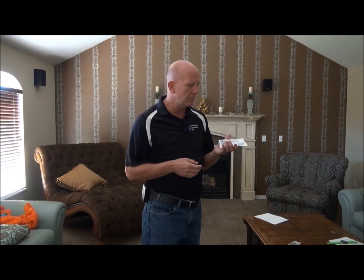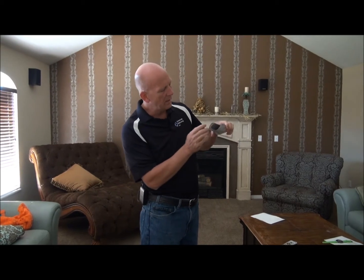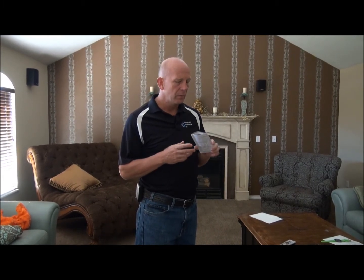The purpose of this radon sample is to basically come to an equilibrium with what's going on inside your house. It just has charcoal inside that measures whatever radon you have in your house — so not to worry about any hazards or anything radioactive. You want to leave this for three to seven days; I recommend three. Leaving it for longer doesn't add to the accuracy at all.